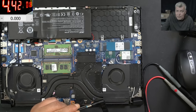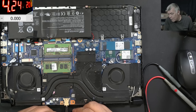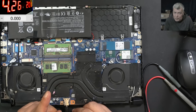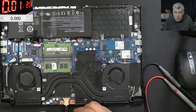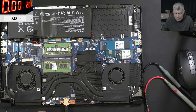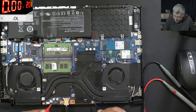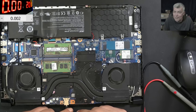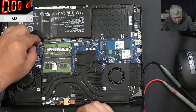Let me raise the current a little bit to 4.6. Now it's fine — it's taking 4.2 amps. So now actually it's working. So if I unplug the battery and plug in the charger, it's taking 10 milliamps. The main power rail is present — LOL! I was wrong. Basically because of that 5 volts power supply, we didn't have the main power rail.